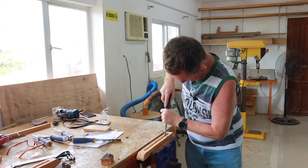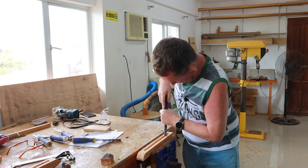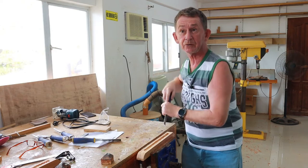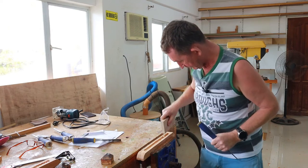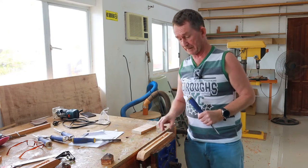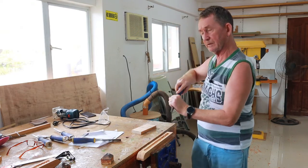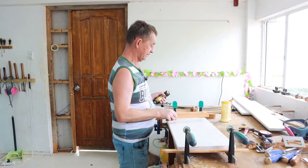If you take little slices like that it's much easier. You can put your hand on the back of the chisel. You can tidy it up later on - you may need to use the mallet on some of it. Rather than going straight down, come in at an angle like that so you're slicing into the wood. Then check your piece of plywood in there to make sure it's going to fit. Don't make it too tight or you might crack the sides. Best to do one side along first, then turn it around - going the other way is unnatural.